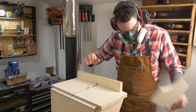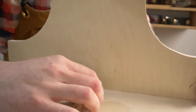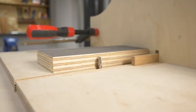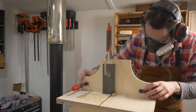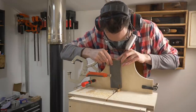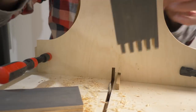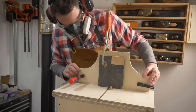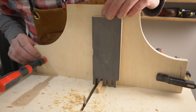I get the sled put on and now I want to position the auxiliary fence. I get that scrap of wood I was saving pushed against the router cutter and then move the pin tight against that. Then I can get it temporary clamped up in that position. I set the router cutter just above a bit of scrap wood I'm going to test this all out on, then I can start making some cuts. The first cut goes against the pin, then it goes over the pin, moving it along and just repeating the process until I get to the end. When it's all done, the bit can be flipped around and the first slot put back over the pin, then I get my second bit of wood butted up against it and make the cut. Then I just keep moving along repeating the cuts until I'm all the way through that piece.